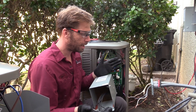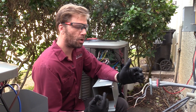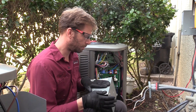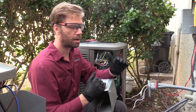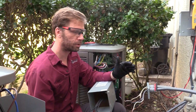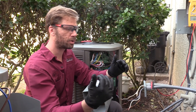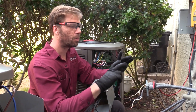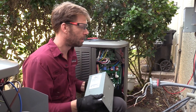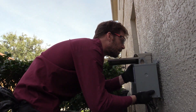I'm going to go over quickly installing this and making sure we get it right. It comes with an installation catalog — you open that up, match the buck and boost model you have to the catalog, then determine your incoming voltage and how much voltage drop or bucking you need. You find out how much voltage drop you need and they give you different wire diagrams to achieve that voltage drop.